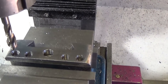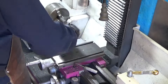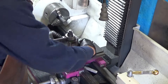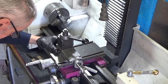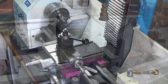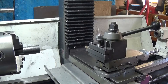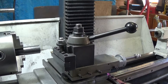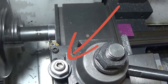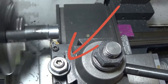All the taps are done. Next step is to make the little knurled wheel that you use to adjust the height of the tool. Now this is one of the disadvantages of having the mill and the lathe as sort of a single unit - every time I want to use the lathe I've got to take the vise off and put the tool post on, then to use the mill again I have to realign the vise every time. Anyway, I've just got some mild steel round bar here that I'm going to use for the little knurled knobs, just like the one here.